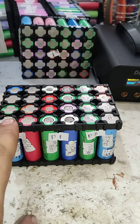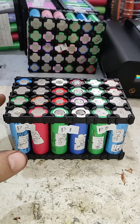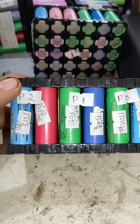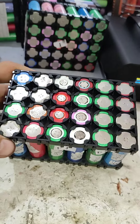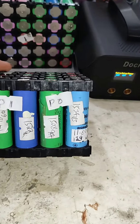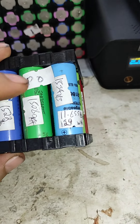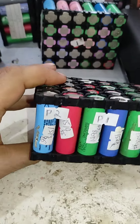Today we will build a 3S 8P lithium-ion 18650 mixed capacity cell battery pack. All cells are tested for their capacity, internal resistance, charge/discharge, and shelf life — they are quality-pass ready and already sorted in the pack according to their capacity data. The total capacity of the 24 cells is 11.655Ah, equivalent to 129 watt-hours DC.